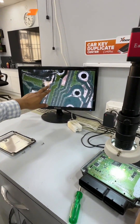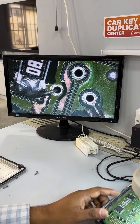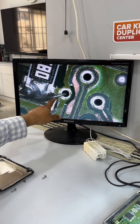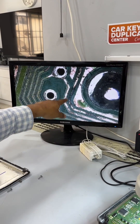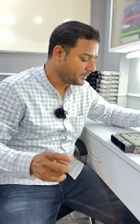Looking at this hardware, I clearly saw that there was some hardware issue previously and someone already attended this board. It was having some resoldering work here and it went somewhere. But here we can clearly notice that there is a slight track damage in the board. So I will go to resolve this issue in the hardware.